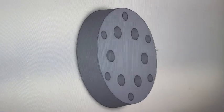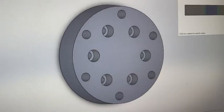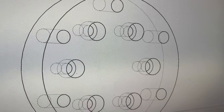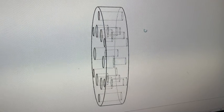It was pretty quick to design this part in SOLIDWORKS. There really isn't much to it. All it is is an extruded cylinder with six counterbored holes for those Allen screws that hold it to the motor and six M6 tapped holes that hold the prop on.